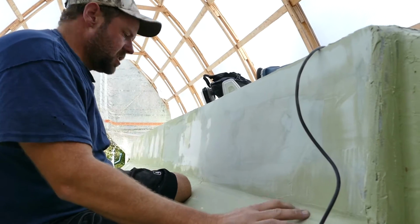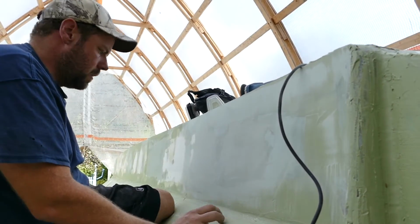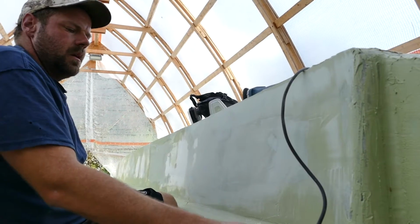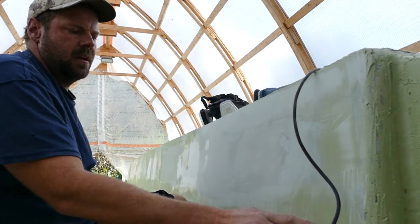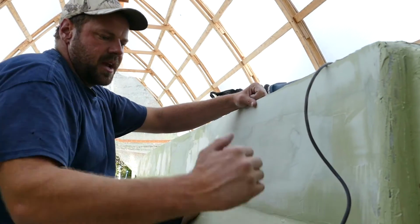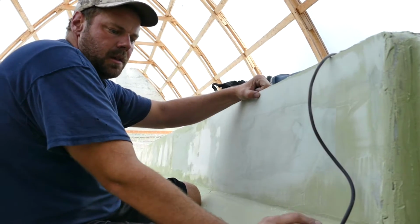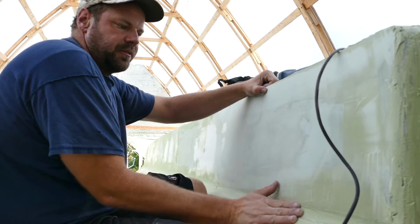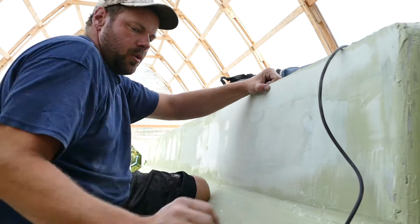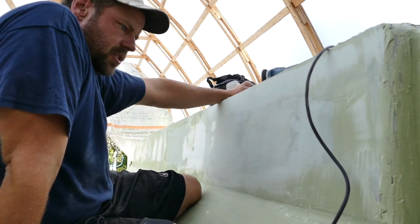So I'm planning on doing the final touches on all the internal corners prior to doing a lot of the longboarding, only because I was having issues. I was doing the longboarding first, and when I went to sand the corners, I was actually leaving an indent in the corner. So we went back and filled them last round of fairing, and I want to do these first and then work my way into that with the longboard. Try to give it a little bit better finish.